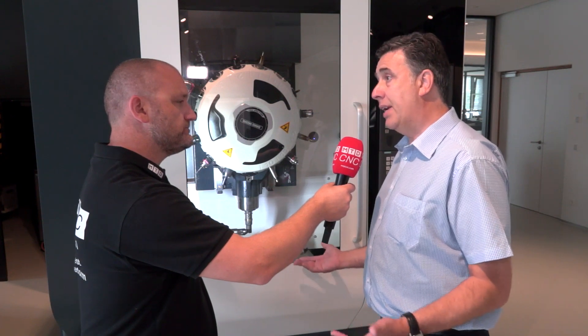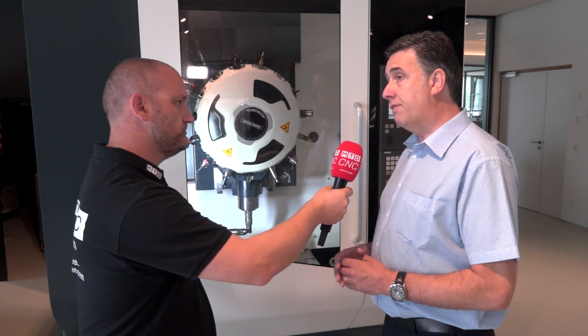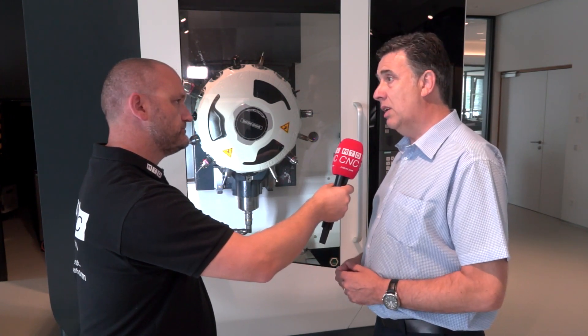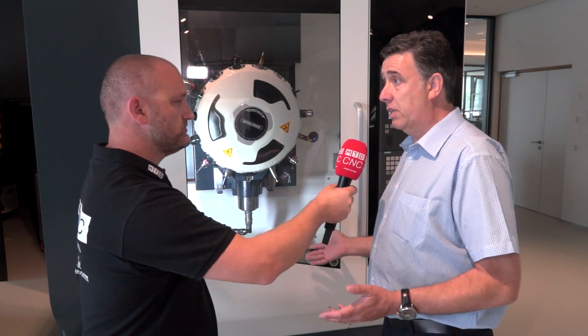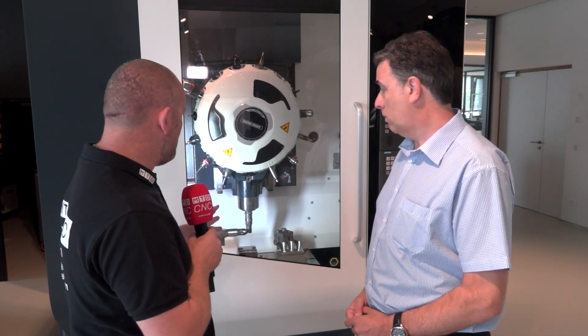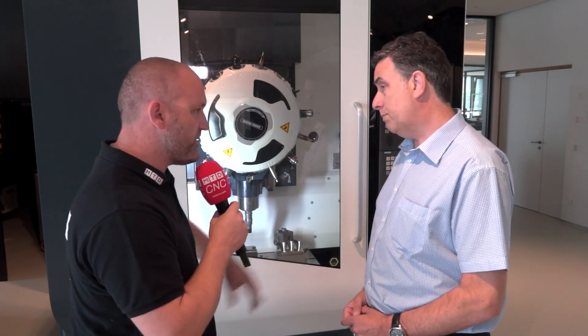If customers are really chasing cycle time, the better solution for measuring these sorts of tools is with a mechanical touch probe. And this is true of all laser systems, not just this one — with a laser you can always measure any point on the tool, but it's about speed. For a multi-flute tool like an end mill or solid carbide drill you'd use the laser, but for a single-insert tool like a boring head, the tactile system is preferred.